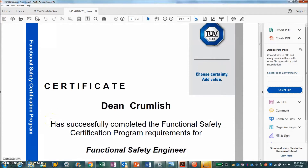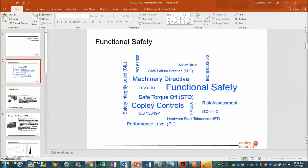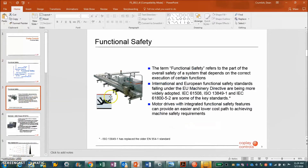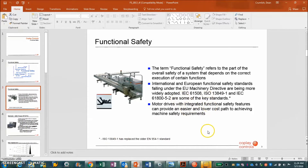I'm going to go through a bit about functional safety and how we arrive at the STO requirement through a SIL 3 level, then we'll look at the manual. Functional safety has a lot of standards and certifications. The basic idea is: if you make a machine, somebody could get hurt — if somebody could die, you better have SIL 3 safety on it. These standards are adopted and change over time. Motor drives can have integrated functional safety to keep system costs lower, so you can meet safety requirements and save money.